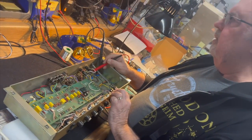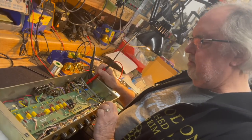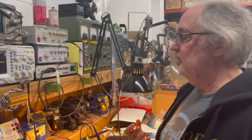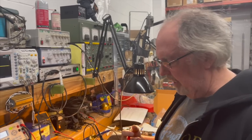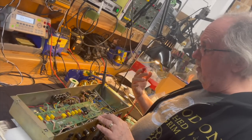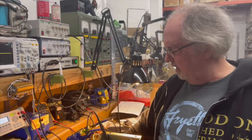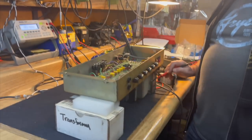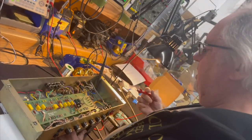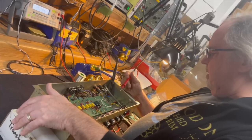Do that again? I didn't capture that. You were giving it the smell test. Gonna use my nose. That's right. Gonna use my ears. And this is really what you do. You can measure and you can use experience, but your ears and your nose tell you a lot about what's going on in an amplifier when you fire it up. You can immediately smell when something isn't right, and you can immediately hear when something's right. You'll hear a capacitor start to hiss if it's going to get hot and is under pressure and starting to leak. You'll hear a power transformer groan if there's an additional load on it. It'll make a sound. You'll be listening for that. And you might even actually feel it from the chassis, and that's why I lean on the chassis and listen and smell when I turn something on.